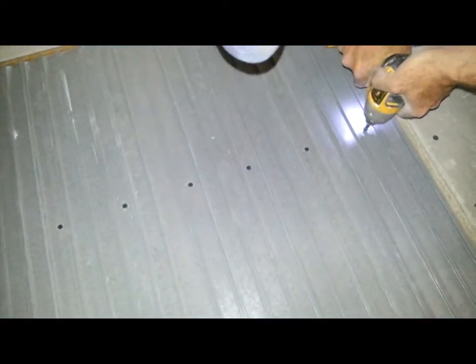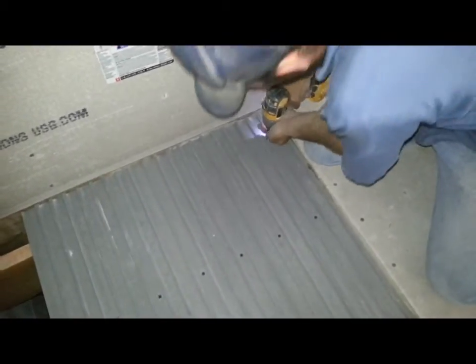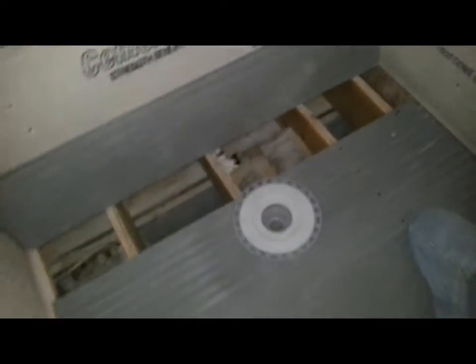We're running some screws down into the TI Pro Board to pull it down tight to the floor joists. It's already getting a lot stiffer. Then we fill that in with thinset — when the thinset dries in all those key channels, this thing dries solid. Each board has a little lip on the edge and the next board has a groove that receives that lip. When those two lock together it's like a pressure fit — you step on it and it locks in and doesn't come apart again.